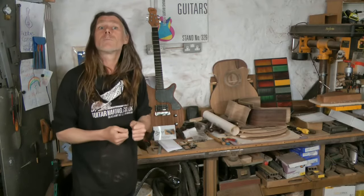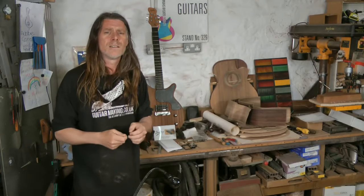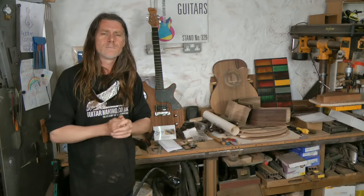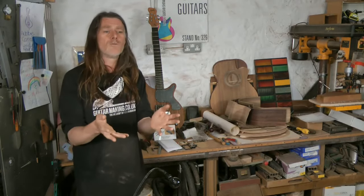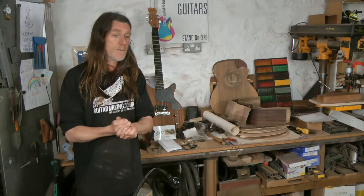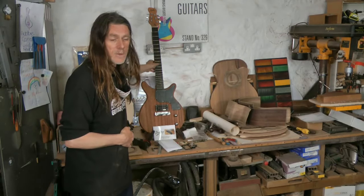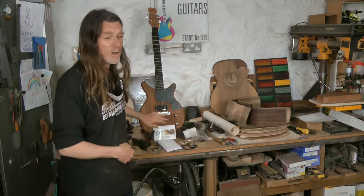Carol's got a question. Evgeny in Russia asked a question a long time ago, and as you're talking about this guitar, he said he's a beginner. What's the best wood that you would recommend to build? On the course, and also in the playlist on the YouTube channel, I've got a video, wooden parts for your first guitar. If you're making a guitar for the first time, I recommend mahogany for the neck and body and rosewood for the fretboard for workability, and also they sound fantastic. You can't really go wrong with mahogany for your first guitar.